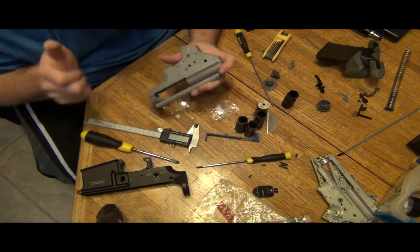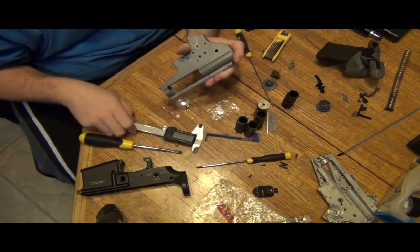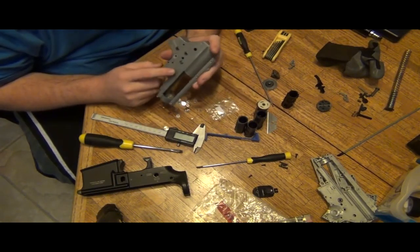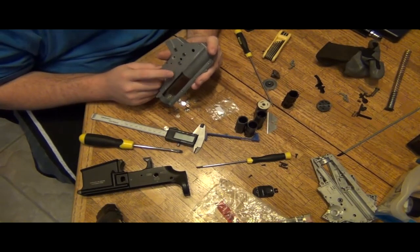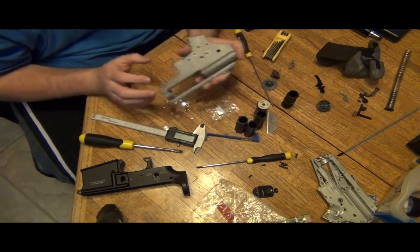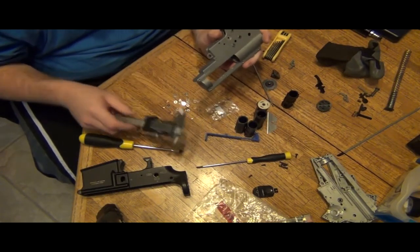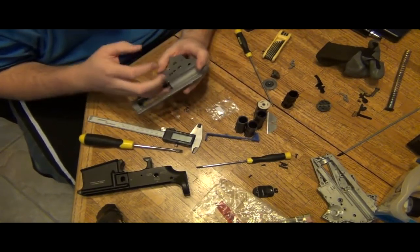So if we want to make this as close as possible, what we would do is, I said we'd use the caliper. We would take our measurements and see if we can get closer. So if the top has, we said it has 0.6 with a 0.15, which is probably 0.16 to be for sure. That's close to, see, 6 plus 2 would be 8. It's close to 8, but it's not 8 on top here. So what we could do is look for another shim that would give you even closer. And on the bottom, it's supposed to be 0.4, but it's not. It's like 0.137. So we could look for something here that equals 0.4 together with the caliper. We put it in the caliper, and then we could trade them out and make this really more precise if we want to.